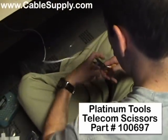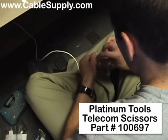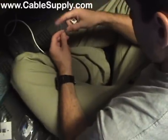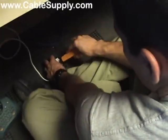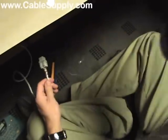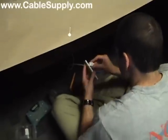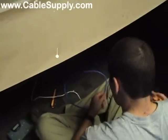He's using lineman scissors — a pretty normal tool to be using in this industry. In this case, this is a voice jack he's getting ready. Those scissors are special hardened steel scissors used for cabling, not your normal scissors from your desk drawer at home. He's using a 110 punch down, and he's only connecting the white-blue pair. The reason is that voice circuits these days only need one pair, and that's called an RJ11.